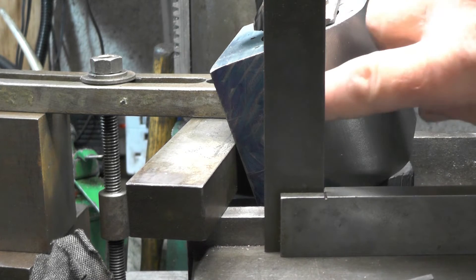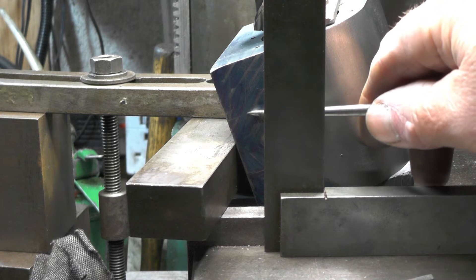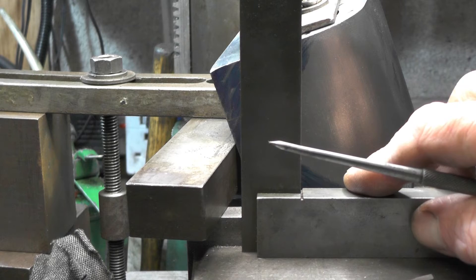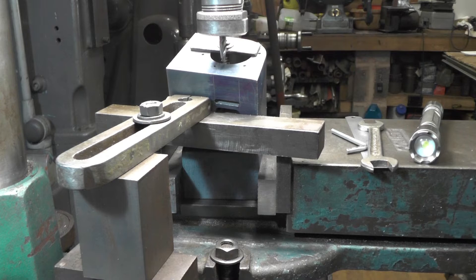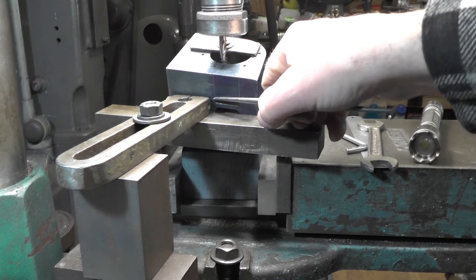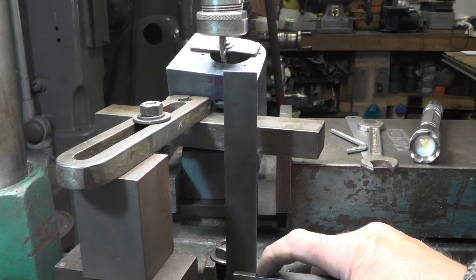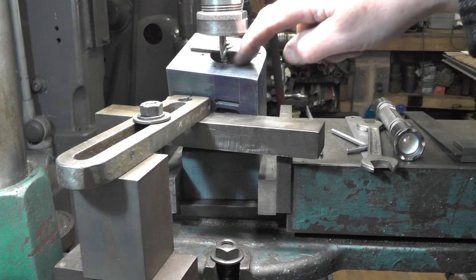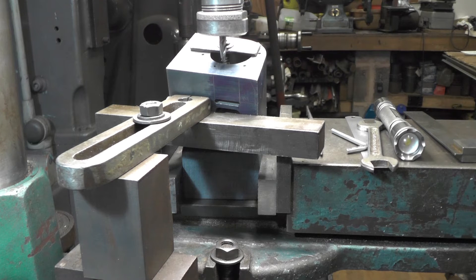There's my perpendicular line - I'm not sure if you can see that on camera - that's the bottom of the slot, and that's my perpendicular line. So I've got that in line with the spindle. Then if we just move over to this view, 90 degrees, here are my perpendicular lines at that 12 and a half degree angle. I'll machine a flat on the edge of this bore to enable me to get my drill started without it running off in a different direction.